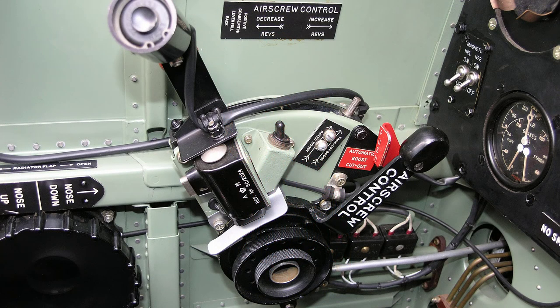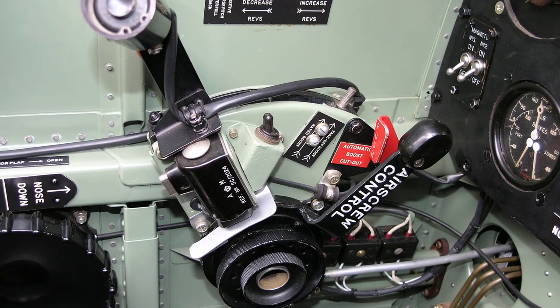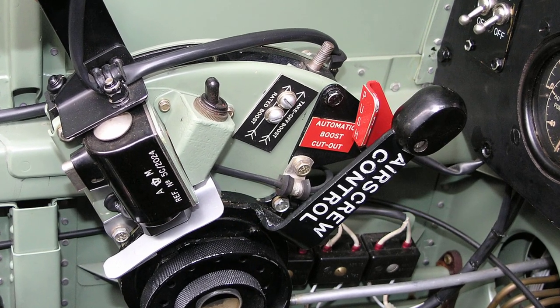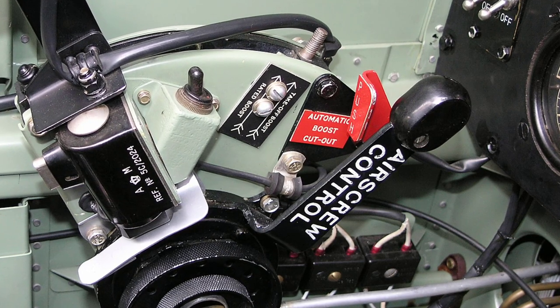In the Spitfire 5, the operation of the propeller is limited to constant speed control. The pilot's responsibility of judging the correct selection of revs per minute is relieved in certain types of governor unit by interconnecting the throttle and propeller controls, so that movement of the pilot's throttle lever to change airspeed will automatically give the correct combination of boost and revs per minute.